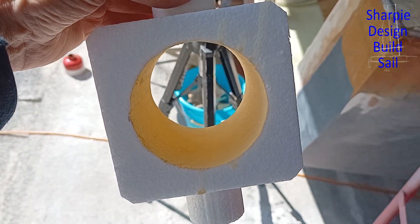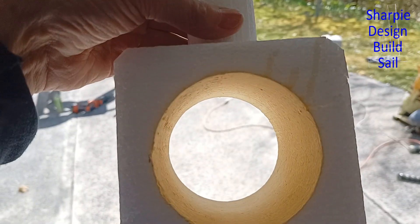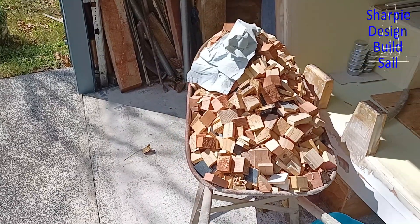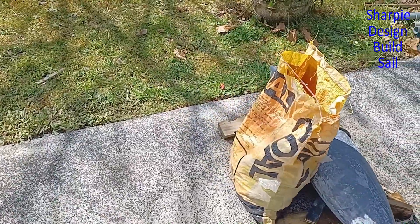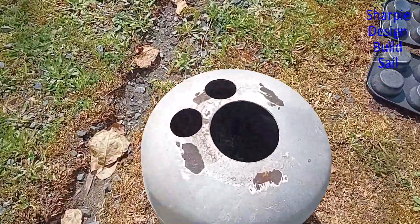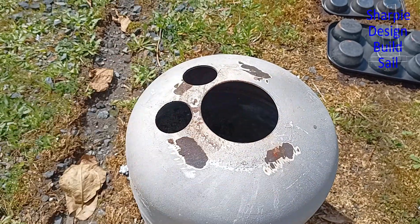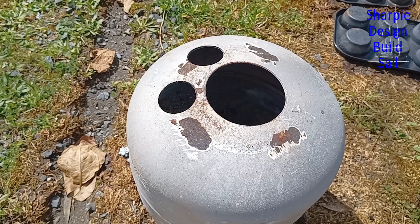Everything's ready to go. I'm just going to set this in the pot here and make sure sand goes right through the hole. That's my only concern and that's one of the reasons I slurried the hole. I don't even expect to get a quarter of the way through that. Got some coal just to help with things a bit. Blower's good to go. Of course as has been pointed out, ideally the furnace would have refractory inside it but that would make it a more complicated job for something I might only use once or twice.